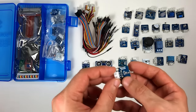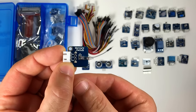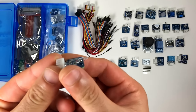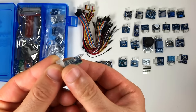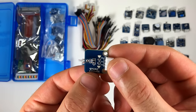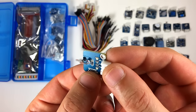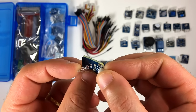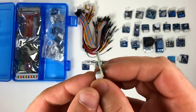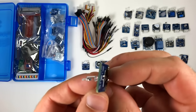This is the mercury switch module. A mercury switch is a type of tilt sensor. There's a small drop of mercury inside the glass bulb — it runs along a conductive track, and when the sensor is tilted one way, the mercury bridges the connection between the track and another conductor. When tilted the other way, the mercury rolls away and the contacts are open. Be careful with this one: you don't want the glass to break. Mercury is toxic, so never touch it with bare hands.